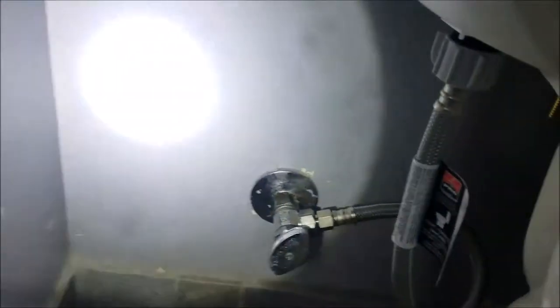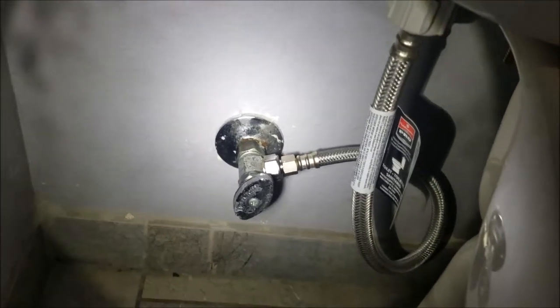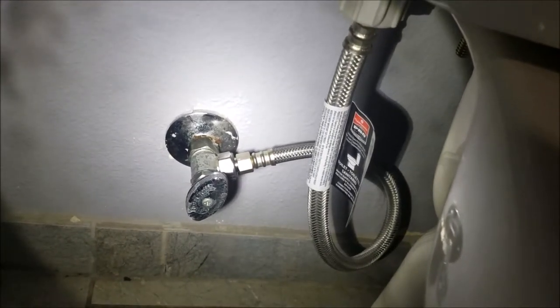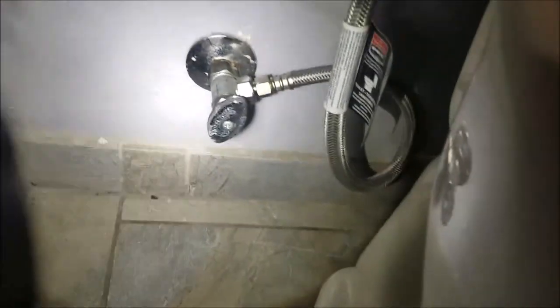What we did is we made an adaptation there. They've got really nice little adapters that go from half-inch IPS or NPT to three-eighths OD, and that's a common size. So instead of changing valves or binding supply lines, we just put an adapter in there. And then this is a brand-new three-eighths by seven-eighths by 20-inch braided stainless steel supply by Fluidmaster. No leaking down there.